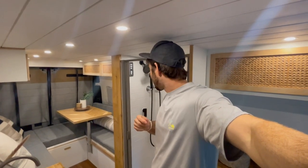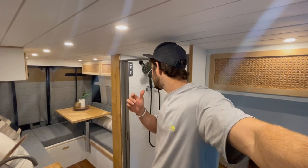Unless you have massive water tanks and a lot of energy to heat up the water, this system allows you to recirculate less than one gallon of water continually. The water goes through a filtration system and then through a heat exchanger to heat up the water, and you only use one gallon. The other beautiful part is you are reheating already warm water, so that's another energy-efficient way to have a longer hot shower.